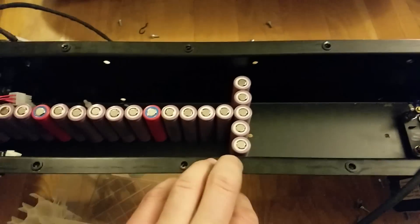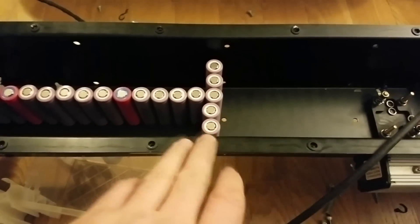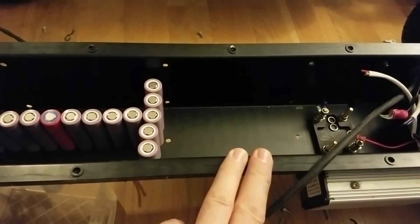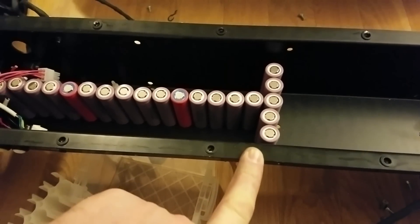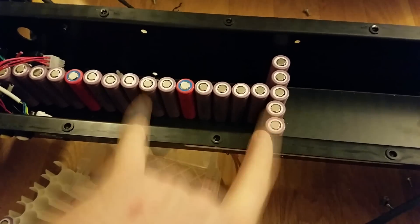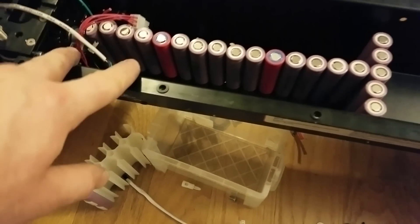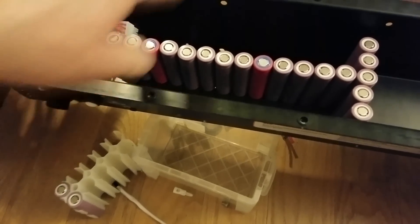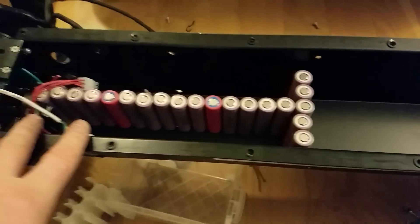Now I'm thinking to do 16P and 5S and connect this. So one pack of 5S, 16 in parallel, and one pack of 5S, 16 in parallel — so 10S, 16P. Or I have to do some math and figure out a pack of 6S and less in parallel. Maybe I can group like 4 or 5 — so 20 or 15 — and I can put them like one cell, two cells. So one cell is 15, 15, 15, 15, and see how much I can fit all the way through.